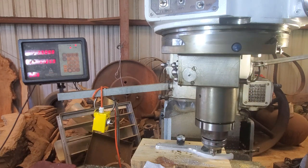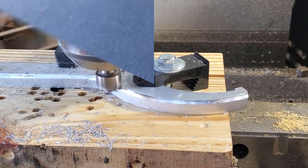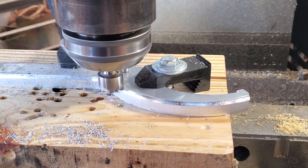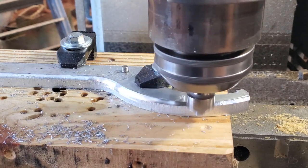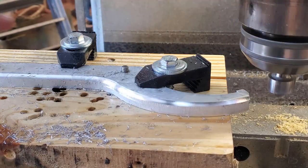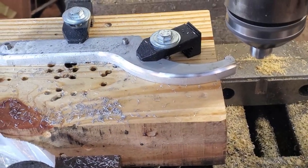The last one is going to be the trickiest. For this last radius the head is offset quite a bit. The centers are two and a half inches past the origin and one and one-eighth inch back from the origin. The critical part is we have to stop this cut when the angle hits 229.5 degrees, so I'll stop just prior to that and creep up on it manually. Looks like a pretty good blend - let's get the part flipped over and do the same operations on the other side.